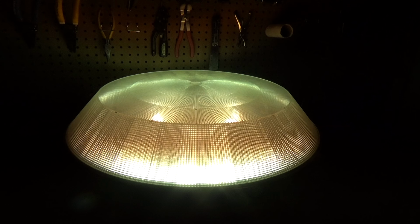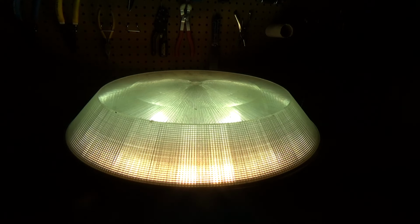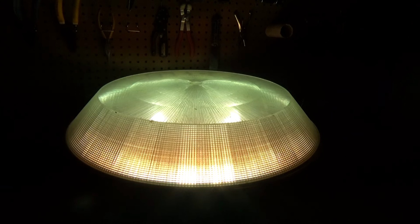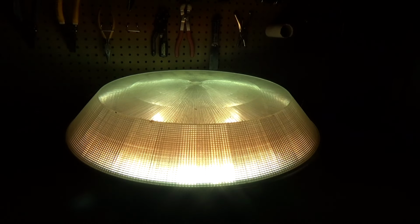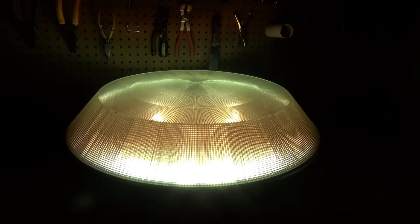So that's pretty much up to full brightness now, I think. It's 2.8 amps right on the nose, 315 watts, but a power factor of 0.97. Actually, the power factor is pretty decent. That's at 115 volts now. 2.8 amps, 317 watts, the power factor is 0.97.